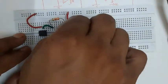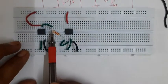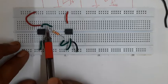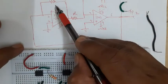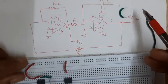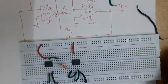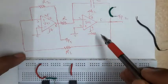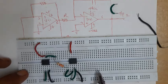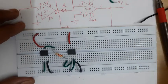This is a skill - someone can use another alternative: you may avoid the extra wire and connect the resistor directly from pin six to pin two, since the resistor itself will act as a jumper. Each wire connects pin six to resistor, and resistor to pin two. For each component you will have to think about a better path. The second thing is that the component layout on the breadboard should look like the circuit on your paper, because while troubleshooting it will be easy to debug when the breadboard matches the schematic.